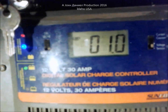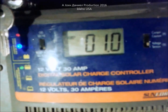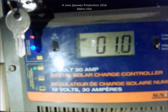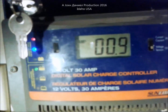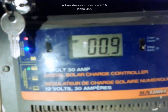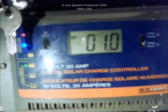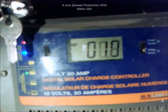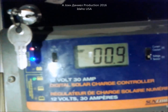But it's basically an amp of power coming in right now - overcast, 30 minutes before sunup - and this is based just on the fact that there's reflective light from the sun way out on the horizon. This gives you an idea why to use amorphous solar panels. I get many more hours a day of charging into my battery bank. They're cheaper, more durable, they last longer, and almost all of the amorphous panels you can buy were made in America.